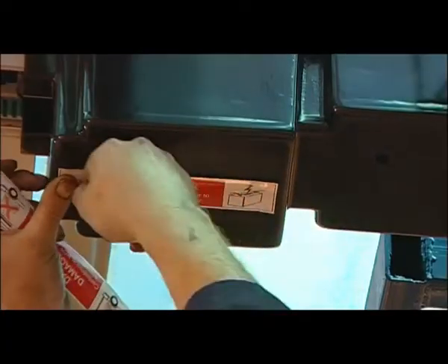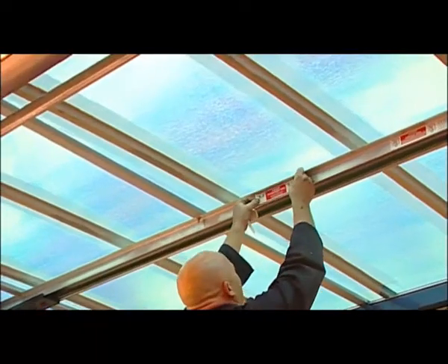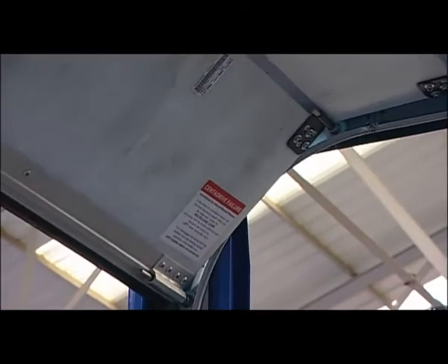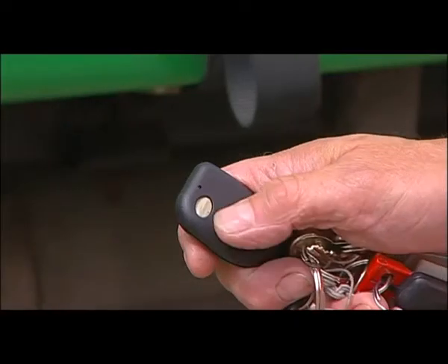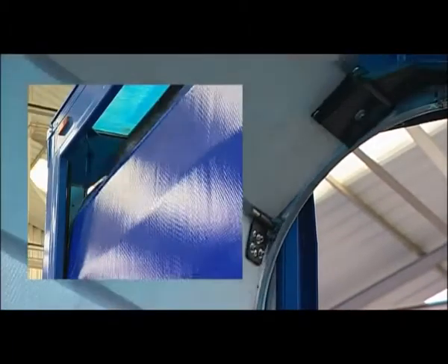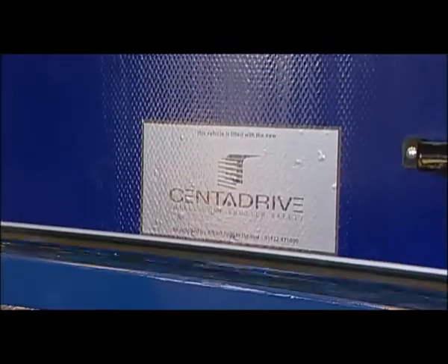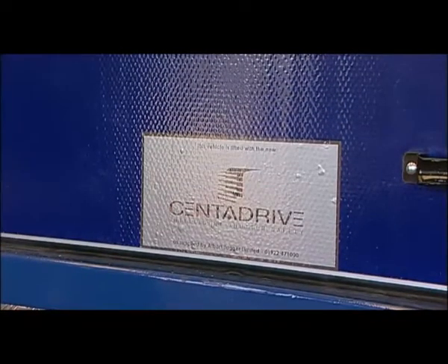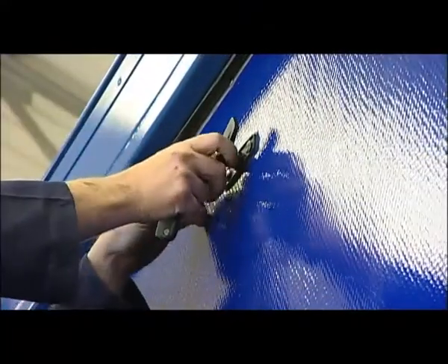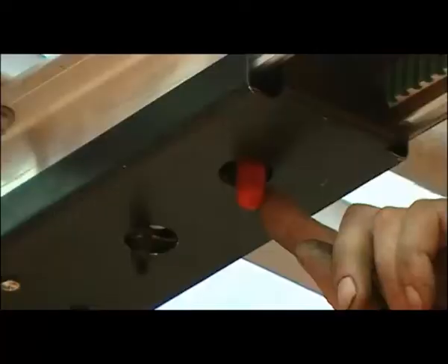Warning signs are supplied for live areas and entrapment risks. Before testing, make sure the door's rollers run free along the tracks. By activating the door from the remote control you can now test the installation. The door should smoothly and quietly open and close, with the bottom door seals just touching the floor to avoid unnecessary stress to the mechanism. It is also worth testing both the external emergency release and the internal release mechanism, which will allow manual operation of the door.